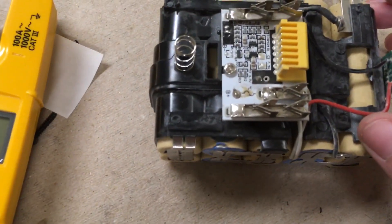I'm going to have to take these home, test the voltage, and run them down. If they went to 4.5 volts, I don't know if I can really trust them. Half of them are bad. I can't believe they're making these packs without BMS's — they're literally fake BMS's, just meant to trick you.